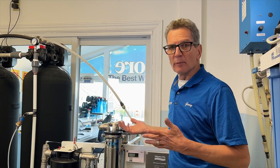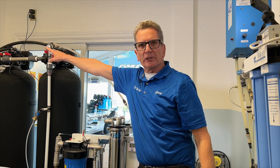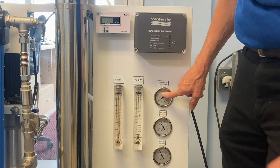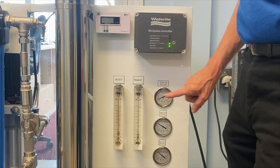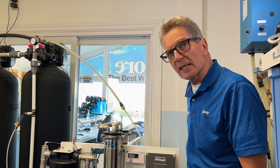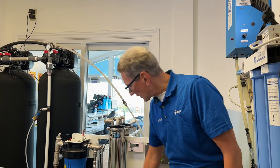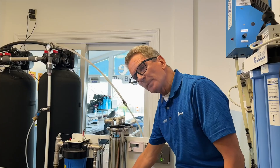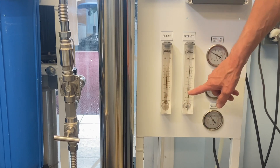Add power and check for leaks, then turn the water back on. You can see the pressure going up — pre-filter pressure, post-filter pressure, and then operating pressure once I turn it on. This system operates at 130 PSI so we need to make sure it's still operating at 130 PSI with the new membranes. You control the operating pressure with the handle — tighten it to raise pressure, loosen it to drop pressure. It's better to start with the pressure too low to flush out all the bubbles.